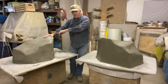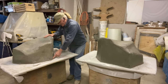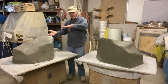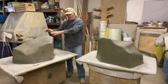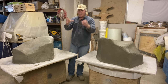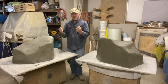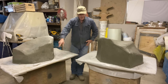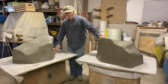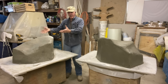My intent is to put another coat of mesh and mud on there, bringing me to three-quarters of an inch total. I threw more mud at the bottom to hold it in place and always fatten up the rim — like a swimming pool bond beam, where pressure is exerted and you add more steel and concrete. That's surcharging. Same principle with this rock. I had leftover mud on both rocks and added more, so I've got a good inch at the bottom. I'm going to turn these over to show they're structural at just 12 hours — cement doesn't reach 75% strength until seven days, yet I'm confident I can move this.